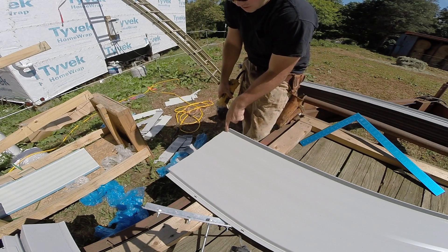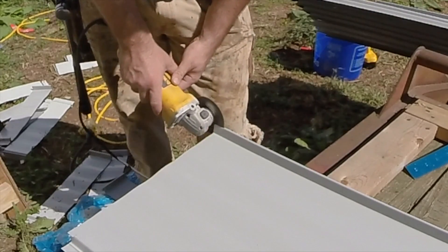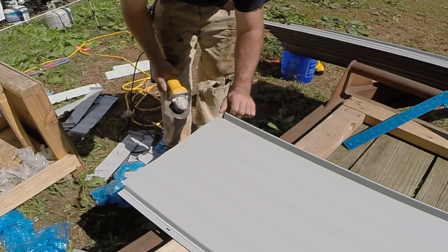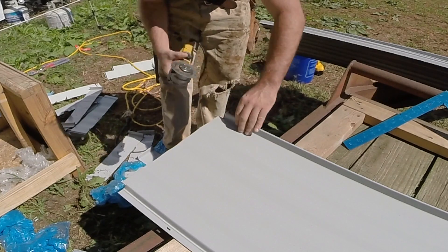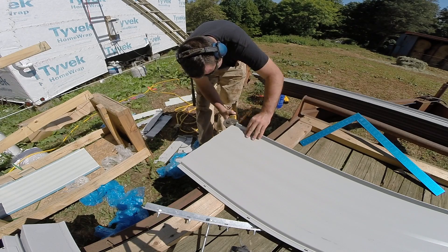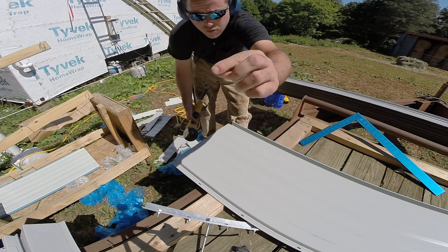Now this last piece, I want to keep this section right here, so I need to make a cut coming in right here and a cut right here. Once that's cut, I can bend this back — be careful, that's going to be hot. This piece is now running down on an angle because of this angle, so I need to cut an angle in it that planes with this plane right here. I'll just go by eye. Once all my pieces are cut, I'm going to go back and remove any burrs created when cutting.